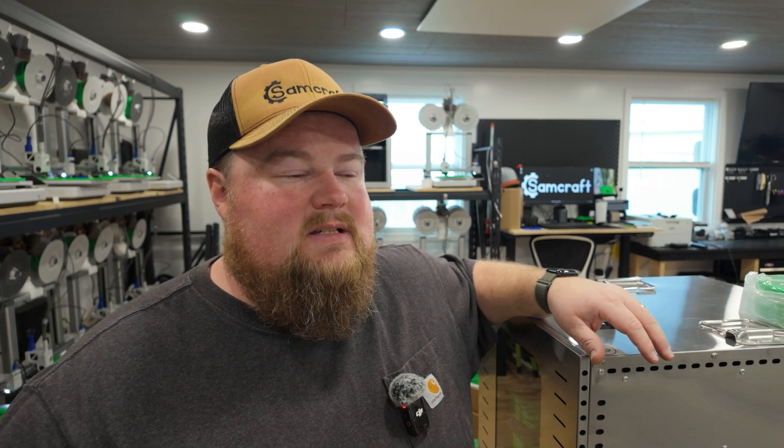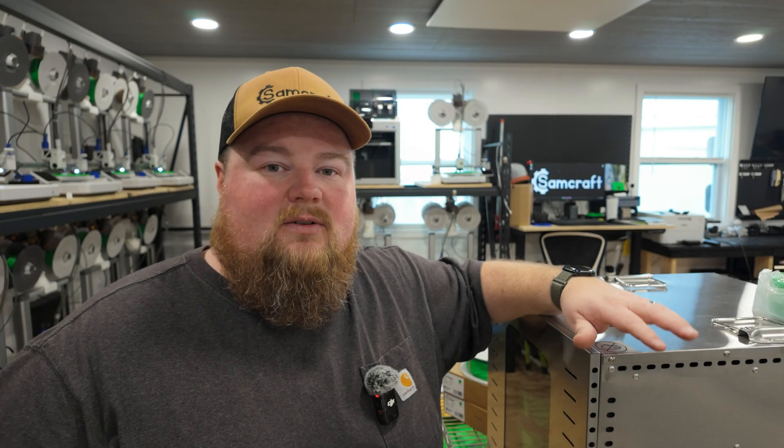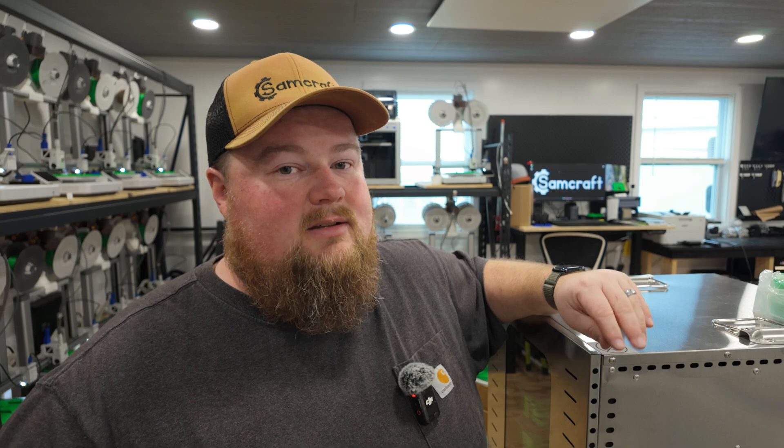One last thing — whether or not to dry your filament is a heavily debated topic among 3D print enthusiasts, so you're going to see schools of thought saying yes and no. My advice is to test it out and see if you think you need it, or if you don't want to bother, just dry it to begin with. If your filament is dry you can always ignore random advice from online forums, because you will know 'I did dry it, that is not my particular issue' and then you can advance to the next level.